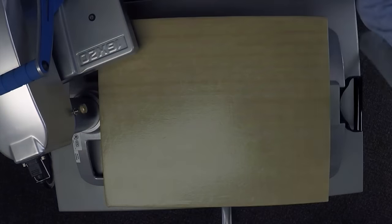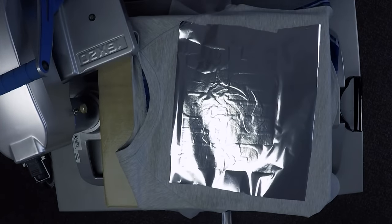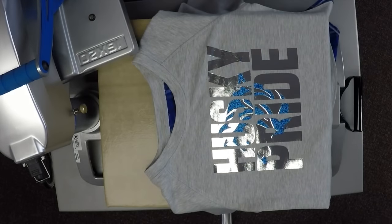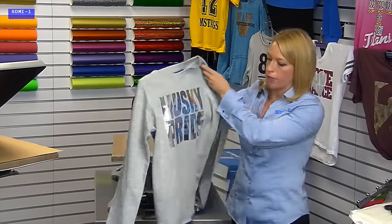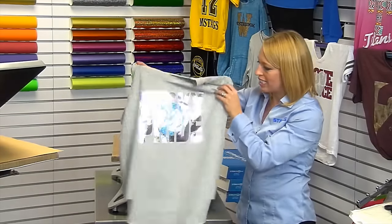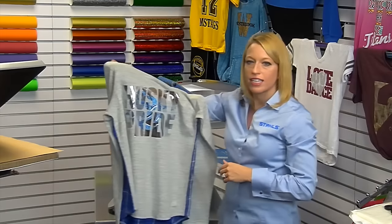The light pressure on the adhesive when you put it down first keeps it from pushing too much adhesive through, so the foil has something to stick to. Then the firm pressure on the foil really drives it further down into the garment. I'll give it a few seconds to cool. For a large production run you'd press them all and peel the foil right before you box them or hand them out. Peeling back the foil, we're getting a really cool print with the foil and Glitter Flake — a unique effect combining the two items on this shirt. This takes the popular knockout print, brings in the same Husky mascot from Great Dane Graphics, and creates a fun print that matches the fun plaid on the back of this Boxercraft flannel shirt.